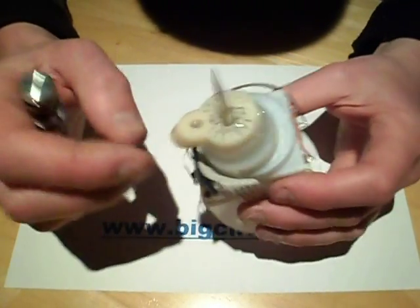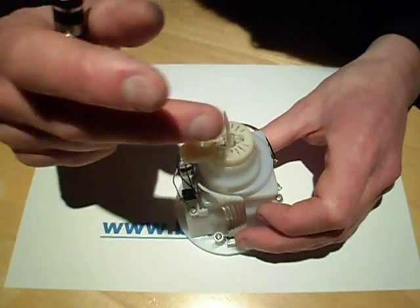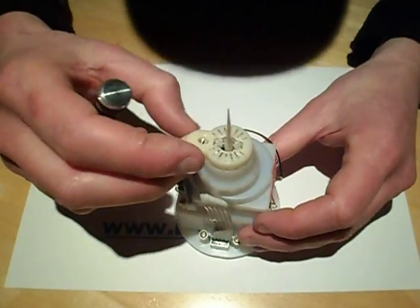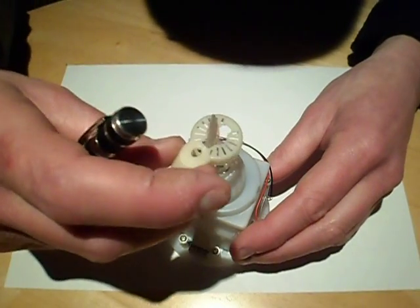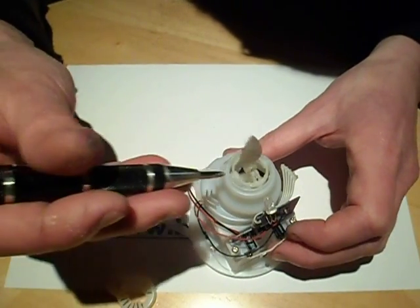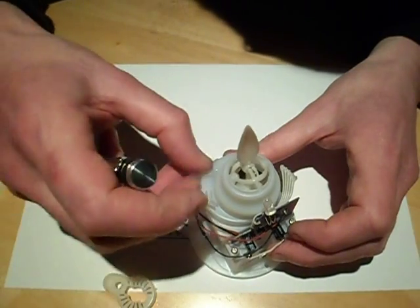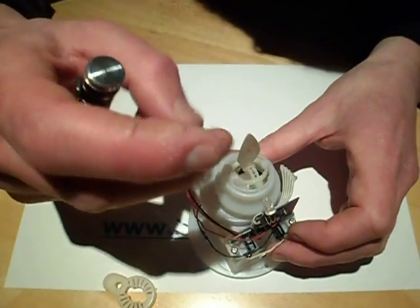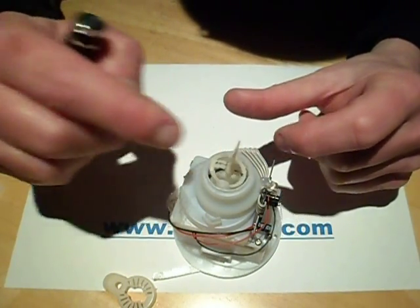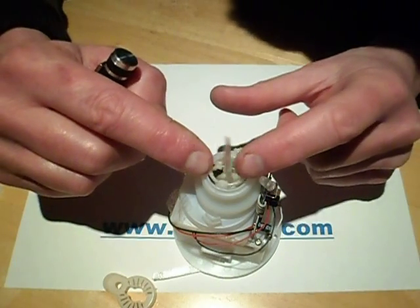Here's the flame mechanism on top — it's different from the others. The other ones usually have an alignment wire with a small dip in it. This one is different. There's a rather strange arrangement underneath with a bit of sticky tape at the back. Oh — it's a little gimbal! I wonder if that was designed originally to give it a backwards and forwards motion, but the way it's working right now it just flops and stays in a fixed position. The only way to fix that would be to put it upside down.